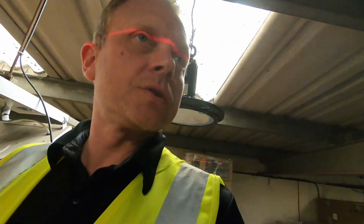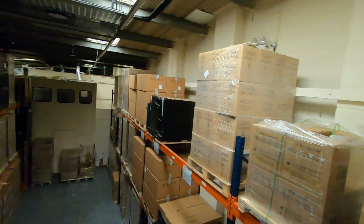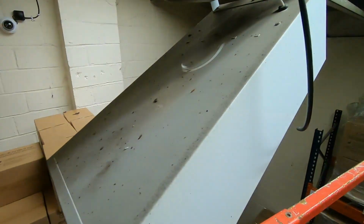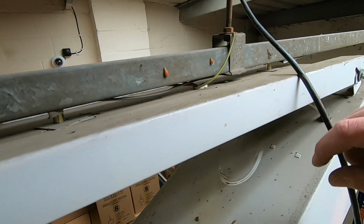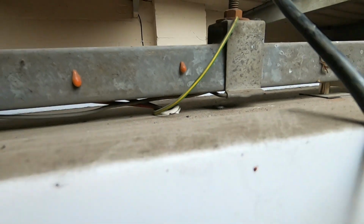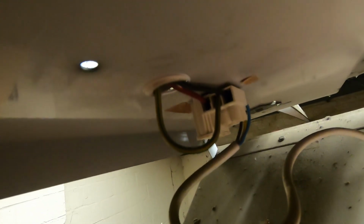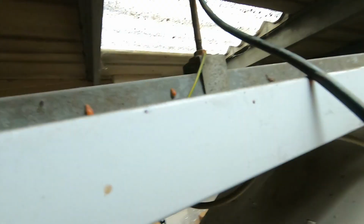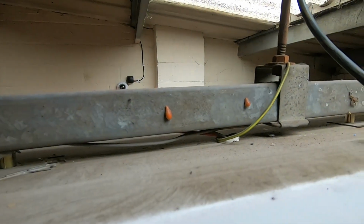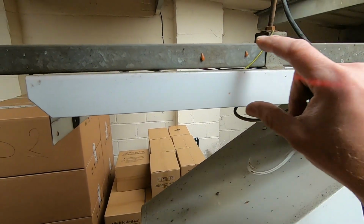Okay, so we're up the scissor lift. I've just done the first 3 lights in this row, which I'll show you now, if you can see those over there. But this light here, I'm trying to take it down. Look how bad that is, the cables going through that grommet, how tight. Yeah, get a better angle. There is no slack on them, they're so tight. No doubt they've been hit by the scissor, the forklift at some point, and it slid the light down the channel.